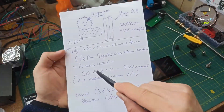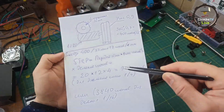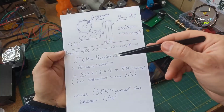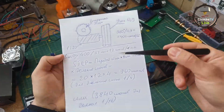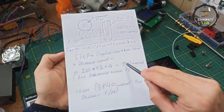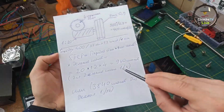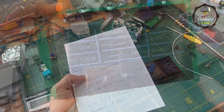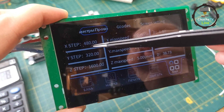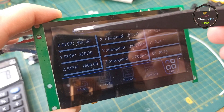The total steps equals gear ratio × steps per mm × microstepping: 20 × 12 × 4 = 960 steps. We set a minimum of 1/4 microstepping. At 1/16 microstepping, that would be 3840 steps. We will now test at 960 steps with 1/4 microstepping. For this demonstration, I specifically put 480 steps — half of what we need — to show the system still works even with fewer steps than required.